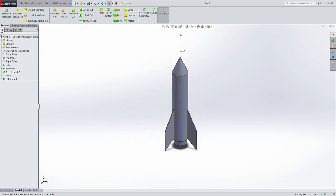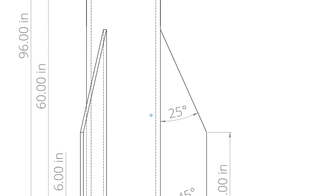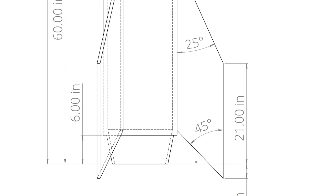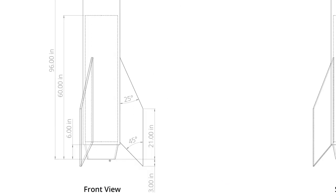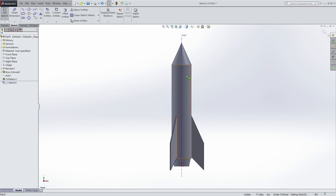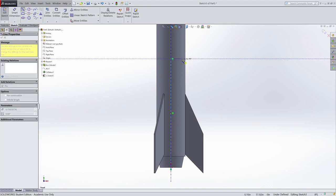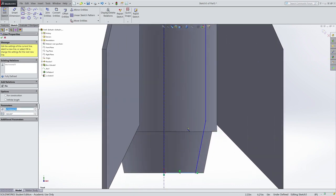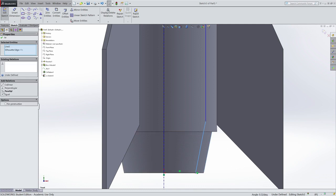I'm very nearly done. I now need to add the cut representing the middle section of the body — the cut representing these hidden lines. I created the cut after the fins so that if the fins extended too far, the cut would remove them. I'm going to use a revolved cut because of the rotational symmetry, drawing half of this cut and then revolving it around the center. So I'm going to create another sketch on the front plane, draw a vertical line up from the origin, over, down, add an angle, and then horizontally at the bottom of the nozzle. Then I'm going to add a relation that this angled line needs to be parallel to the outside of my nozzle.